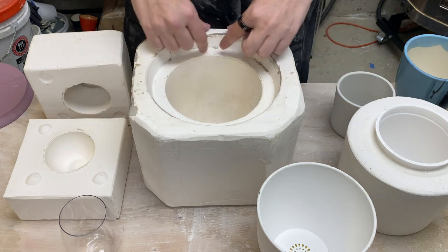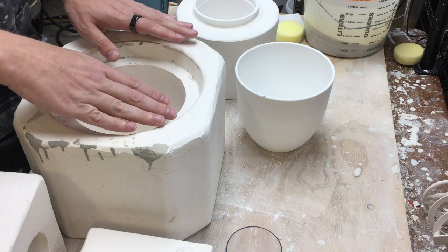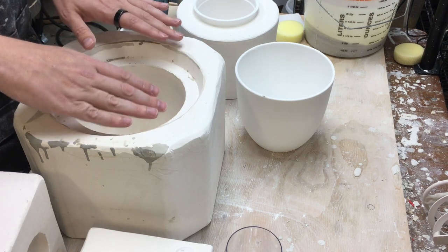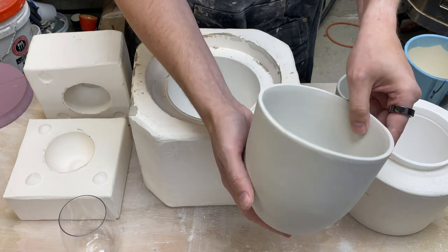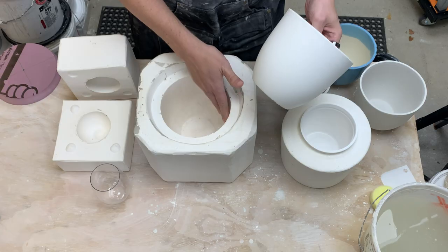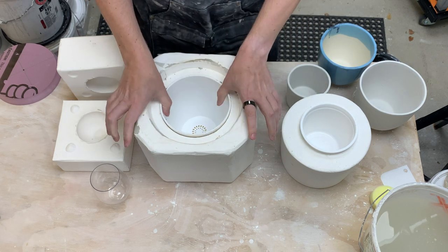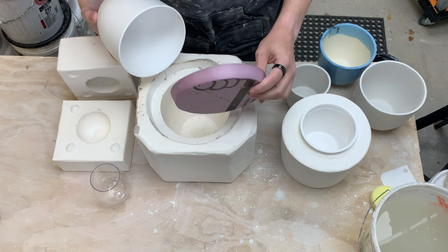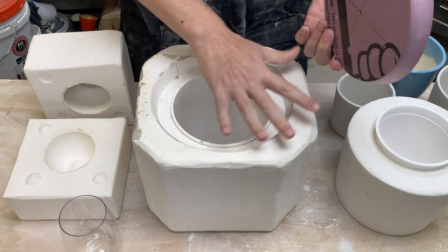Next I made a copy of this planter here, so it fits down inside here. In making this mold we did two things. One is we poured the plaster upside down so any of the bubbles would go towards what would be the bottom surface for slip casting — that results in a nicer finish for our pot. The other thing we did is this piece right here, which is a slip well. The idea is that we pour the slip above the edge of the pot so that as the slip goes down and water is absorbed, it doesn't actually impact the pot itself. To create the slip well, we used a piece of foam, so I had to create this and adhere them together so that we could pour the plaster around it.